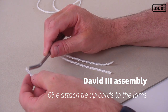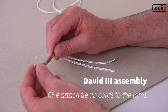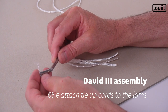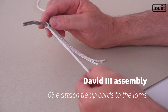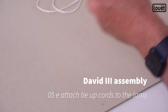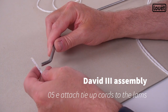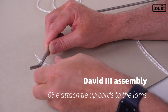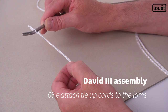So I'm looking visually at this loop each time, seeing where was the melt, where did it get cut, and then selecting the first usable loop after the cut. In our quality control process, every few minutes while we're cutting these cords, somebody is actually counting out the 12 loops to make sure it's the right length. And this is number 5, and we'll flip it around. And that's a rather long one, so I just want to check. 2, 3, 4, 5, 6, 7, 9, 10, 11, 12. That's good.